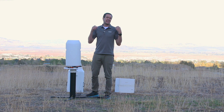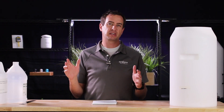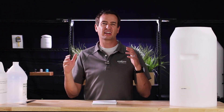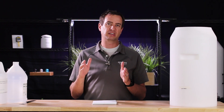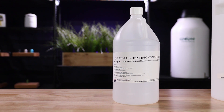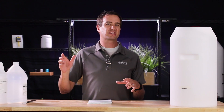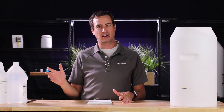Now you're ready to add fluid. When recharging your precipitation gauge, we recommend that you do it sometime in September, October, or late fall. That way, the minimal amount of antifreeze is required for the winter. We recommend using an antifreeze that has a ratio of 50-50 propylene glycol and ethanol, something like the Campbell Scientific CS705.